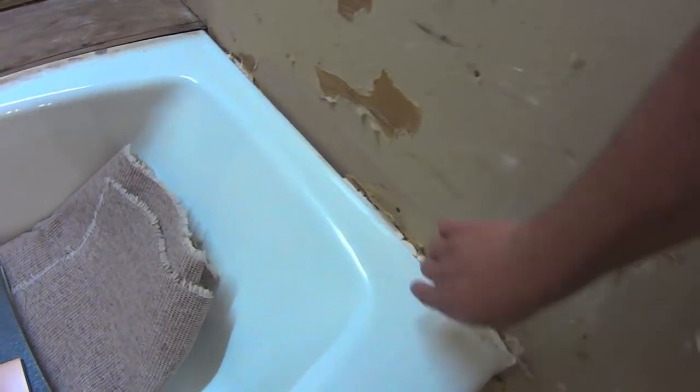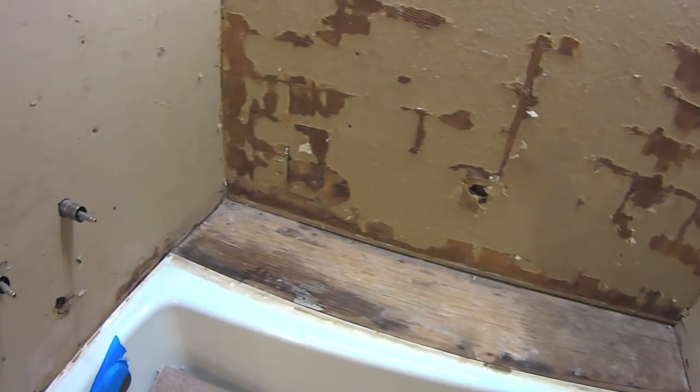They apparently used some sort of rubber, some sort of, what am I looking for? A waterproof layer, membrane, whatever that they put up. But the tile was right on top, so it almost looks like they just put this membrane, a putty, wax, whatever it is, and then put the tile right on top of that to help protect. And of course, they grouted stuff. You can see down here where they have that membrane, but then they also have the grout. So with time, that waterproofing stuff failed.